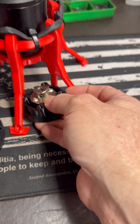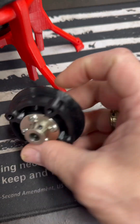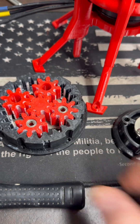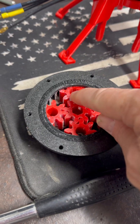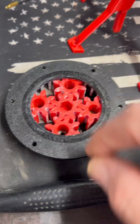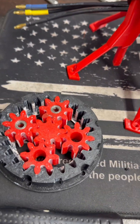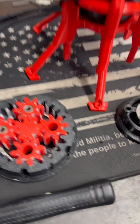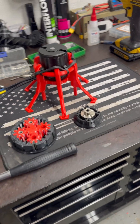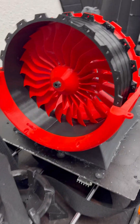This will go and index into the motor shaft, and then that will drive the bearings — there's going to be five bearings all the way down. On the back side I'll have little plastic or PETG rings that I put in there and CA glue in place so that the bearings can't get pushed through the bottom, but it'll leave room for the rod to go through. That's gonna look good.